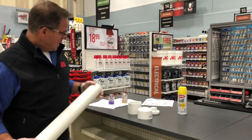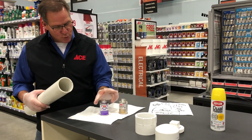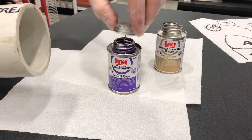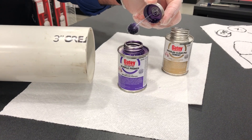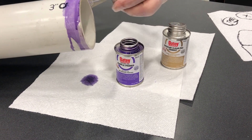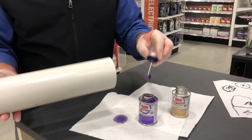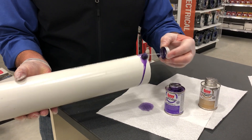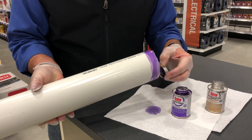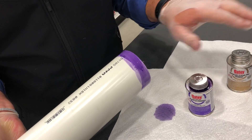This is a piece of three inch pipe. Because we're going to bury this in the ground, we actually want it to be water tight. For plumbing, you've got glue and primer — this is a purple primer. I'm wearing gloves because this stuff is super sticky. It comes with a little brush already on it. Now look at the top of the pipe — you see that black lettering? Watch what happens when I put the primer on there — you see how it makes it disappear? That's actually cleaning the pipe and prepping it for the glue. These are petroleum based products, so make sure you're using them in a well ventilated area because this is all very flammable.